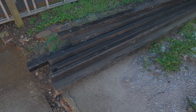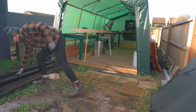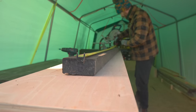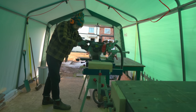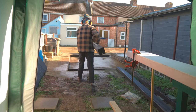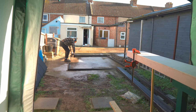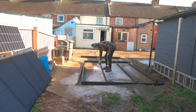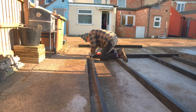With the ground clear, the first job was to work out the size I want the base to be. I can get them marked out and I'm going to cut them to length using my new mitre saw stand. I don't have any wood long enough to do the whole length of the base so I'm going to get two different frames screwed together to make up the whole thing, and I'm just going to get this all put together with some deck screws.